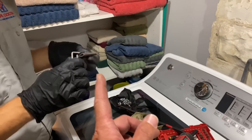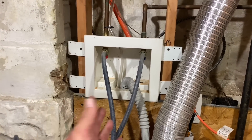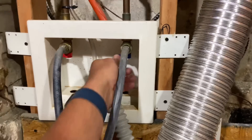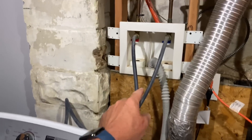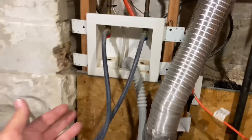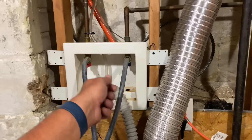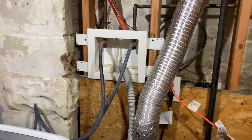For all you homeowners, DIY guys, plumbers, and HVAC guys — get into a habit of closing the valves on your washing machine box. The most common insurance claims for water loss are burst washing machine hoses. By closing these, if they were to burst, the problem will be isolated. Get into a habit of closing your washing machine valves. If you don't have levers, consider a single lever valve like a Watts washing machine valve — easy peasy. Also don't forget to clean your dryer vent once a year.